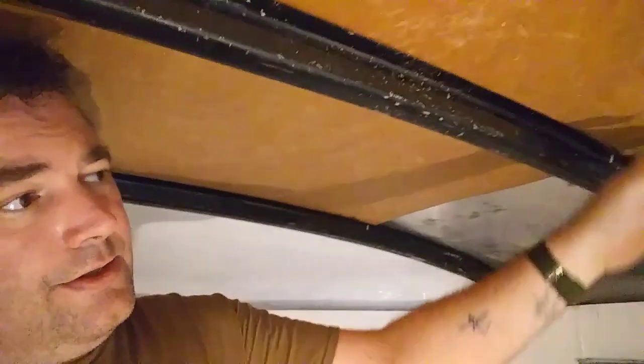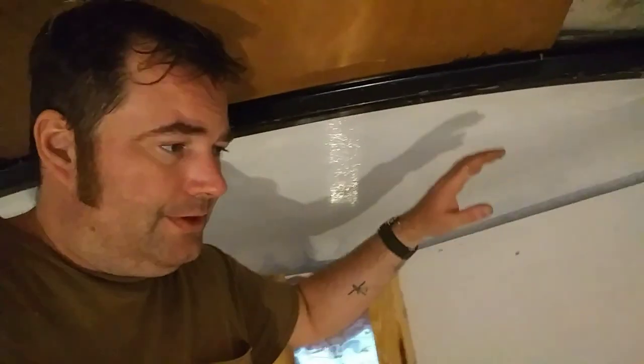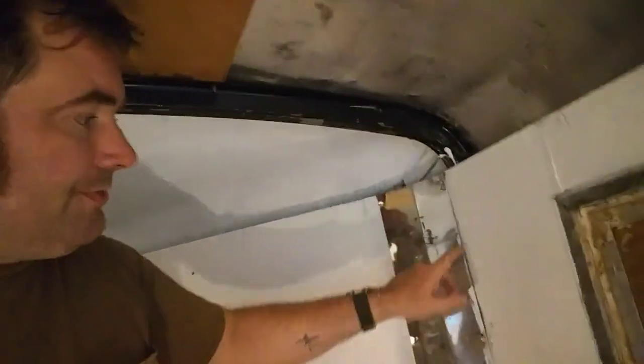So I haven't done anything with the ceiling yet. I'm still debating on that. I might get some thin plywood like what they got up here, sleeve it in. Then again, I might actually just take that out. I wished I would have had the finances to take all these boards down, insulate, and come up and put nicer, thicker wood instead of this real thin paneling board. Because when I go to mount something, I have to make sure I hit these ribs and the ribs that shoot across. Because if I don't, I've only got like 1/8 of an inch of wood material to anchor down in, and of course that's not anchored down. But if you hit those metal channels in there, okay, that's anchored down. Of course, having thicker plywood, OSB board or something like that, it anchors down a lot nicer.